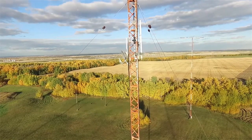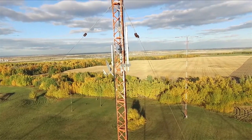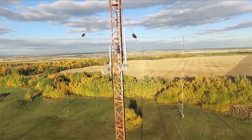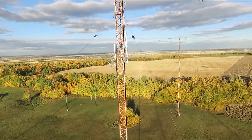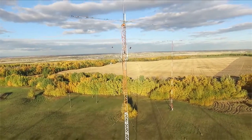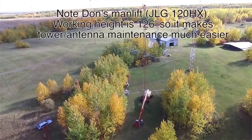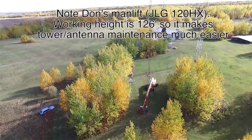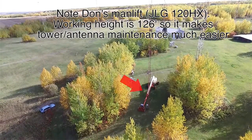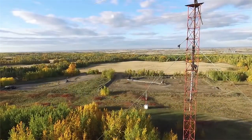The 80-meter Yagi is shown in various stages of construction. The Yagi is fully rotatable. It uses 30-inch sprockets and a worm drive gear reduction system with a half horsepower AC motor for drive. And that is about the extent of the background information of the antenna farm at VE6JY.